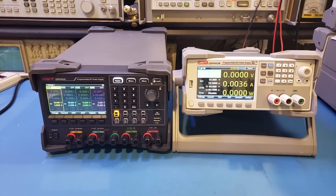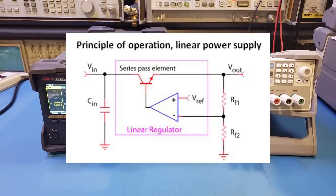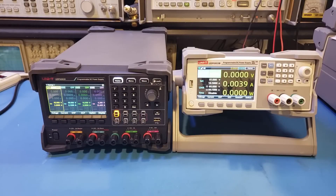Before we go any deeper, let me briefly explain how linear power supplies and switching power supplies work. A linear power supply essentially uses a linear component, such as a transistor, operating in its linear region to drop the input DC voltage to a predetermined level — fundamentally equivalent to a variable resistor in series with the output. The negative feedback loop ensures that the output voltage is well regulated. A switching power supply has a switching mechanism built-in. The switch rapidly switches the input DC voltage on and off, and the output gets converted into lower voltage via a pulse transformer. The output is then rectified and filtered into DC. By adjusting the duty cycle of the switching signal through pulse-width modulation (PWM), the output voltage can be adjusted.